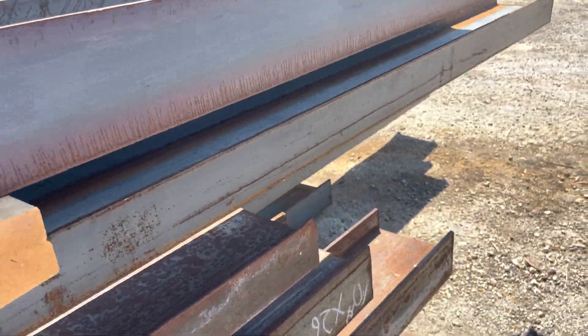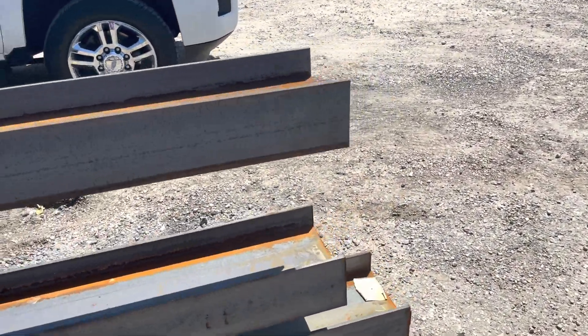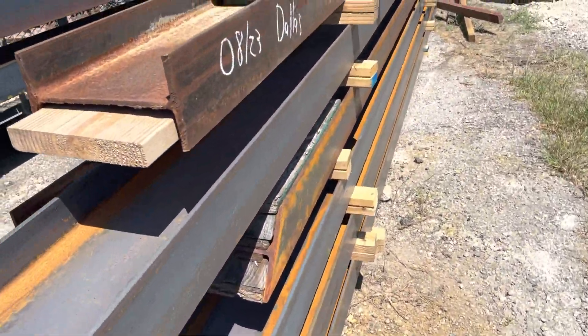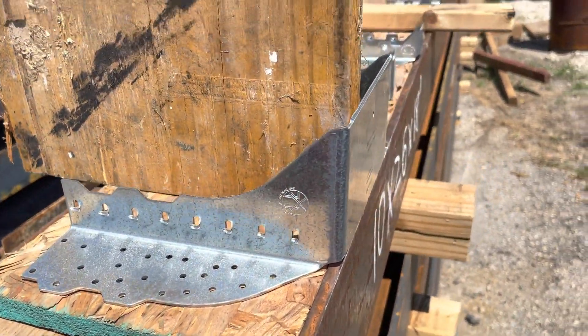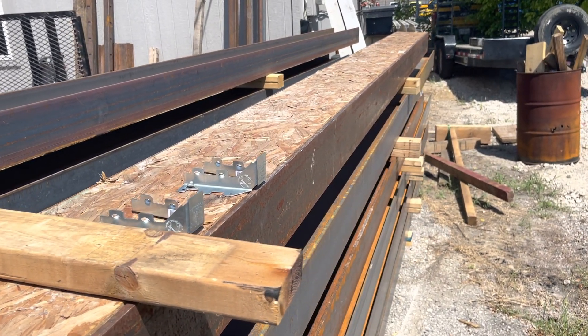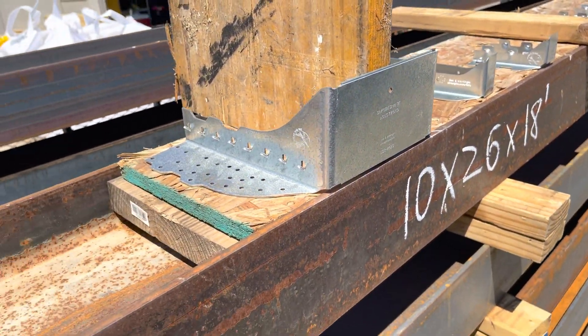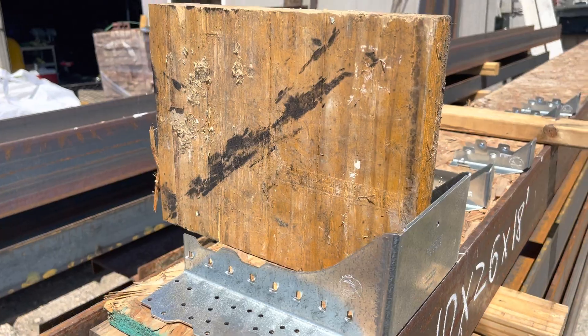We also get a lot of questions about: you put steel in my house, and I know my house is primarily constructed of wood — how do I get it to transition back from steel? So here's what we get into right here: it's called packing the beam. You can look down this beam and it's packed with OSB — oriented strand board, kind of like plywood, made of a bunch of different chips. After we put that packing in there, we come back and do the framing connections.